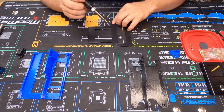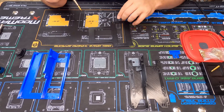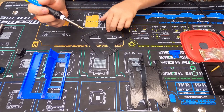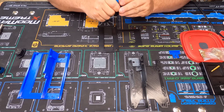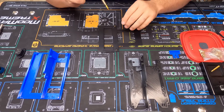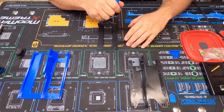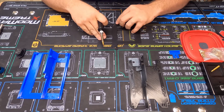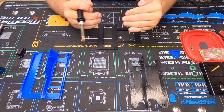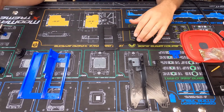That ought to be pretty close — just a little bit deeper. There it is, a little brass insert. Let me do the next one. I already chased these threads. Real carefully, get it started — just slightly melting — a little bit of pressure. It doesn't take a lot of pressure. When I first started with these, I didn't have enough heat and was pushing too hard; it wasn't even melting the plastic, it was just deforming it. Now those are both put in.